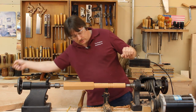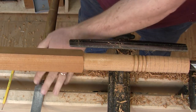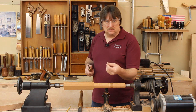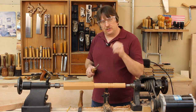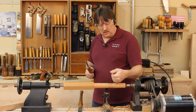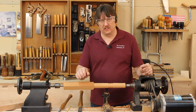Most people think you just grab a gouge and jam it in there flat, but you're scraping again — getting the same scraping action we had with the skew, which gives you all those flat scraped-off fibers. If I show you how to cut with a gouge rather than scrape, you're going to get a much, much cleaner cove. I'm going to turn a few more beads and then come back with the gouge.